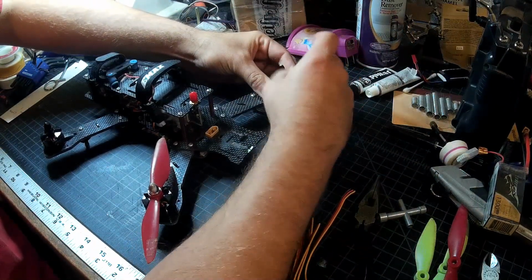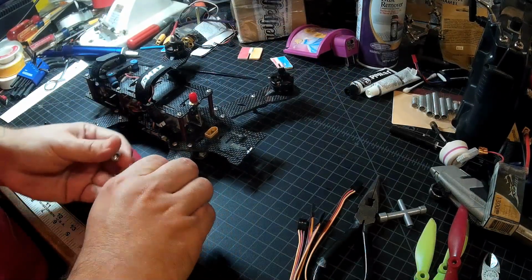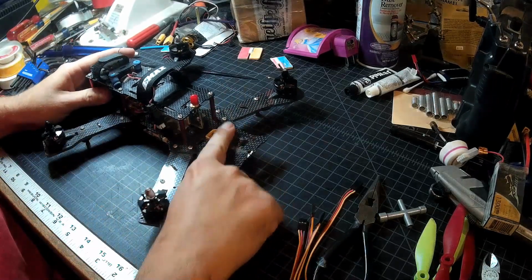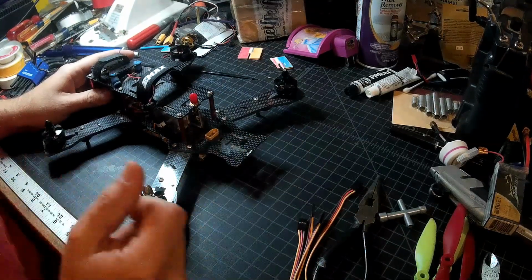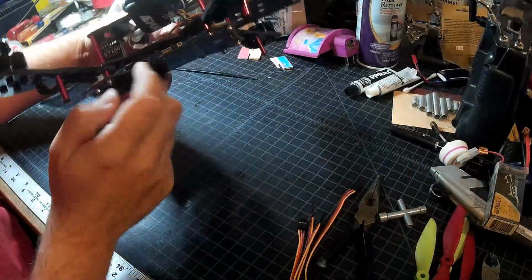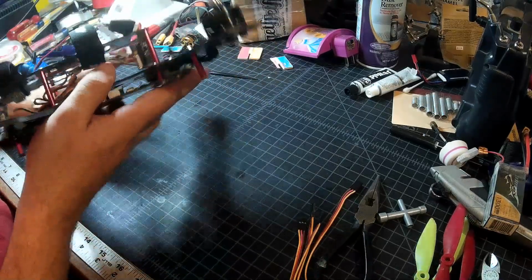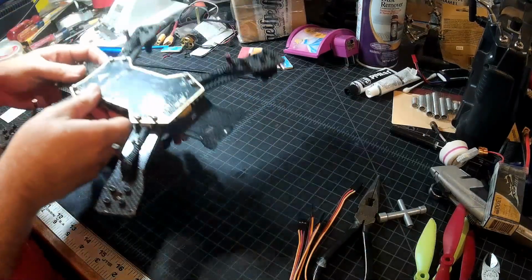Now you'll notice, of course, as I've covered before in a lot of my posts, but not my videos, I've modified my Nighthawk quite a bit here. I took off the light bar to save weight, because I don't really need it where and how I fly. And I took off the transmitter that came with it, because I felt it was too exposed, and it doesn't work with my Boscam receiver. So I just put on this Eachine, super cheap. It was one of those deals where you get the whole thing ready to go for 20 bucks or 30 bucks or whatever it is. Unfortunately, in my last crash, I pulled the wire loose again, but that's no big deal. I'll pop that on before I'm ready to fly again.